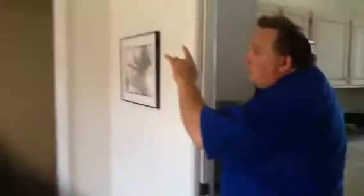In the kitchen here, Mike, another pocket door. This was fine, it's on track, that's good. By the way, we had 2 smoke detectors, they were functional, outside of the bedrooms, okay? Now, in the report, my suggestion is to upgrade. In a new house today, it's code now to have smoke detectors in every room except for kitchen and bathrooms. So you want to upgrade, that's a smart investment.